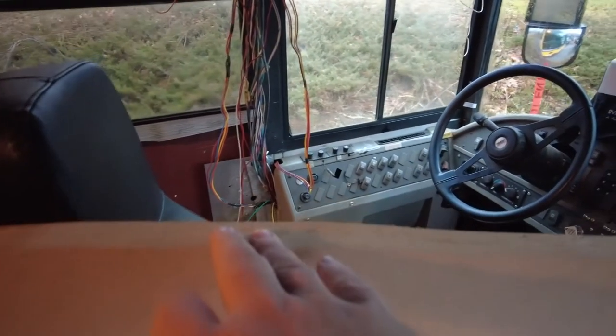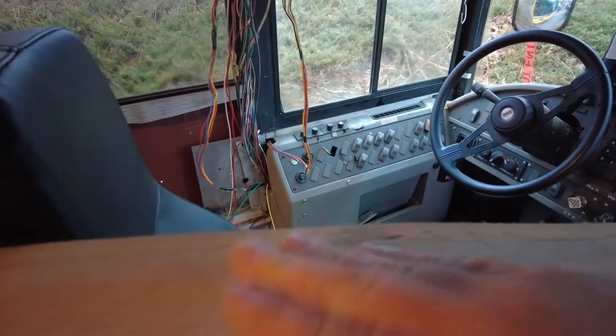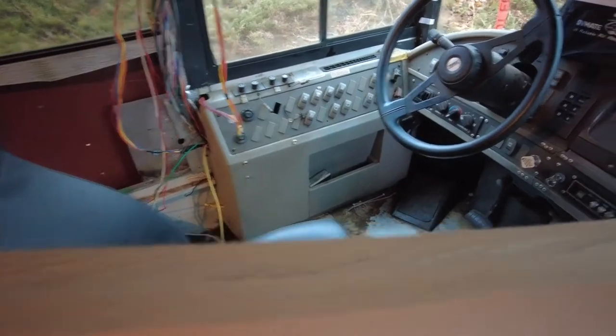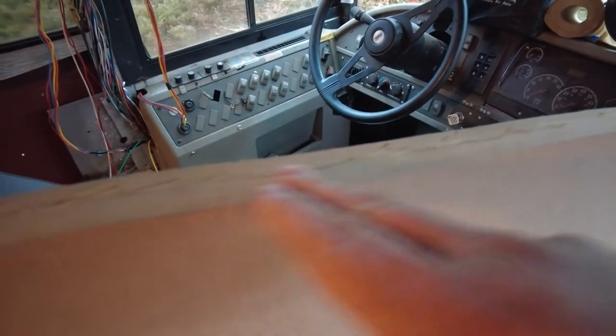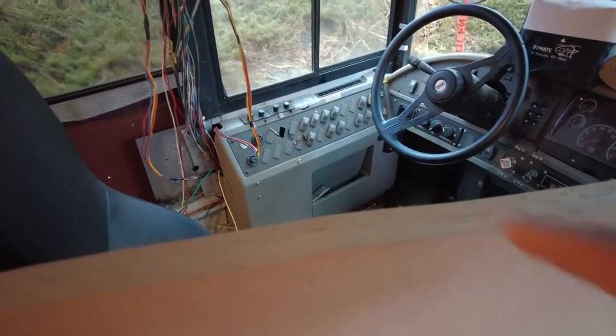It's not as shapely as I thought it would be because it was more accurately following my hammer form than I thought it could. So the hammer form, being what it is, just some MDF. And what I have done is I have screwed them together, and we actually drill and then screw through the sheet metal, and we bend it over. You can see my hammer marks where I missed, but you can also see where there's some waviness in here, and the metal that's over there actually picked up that waviness, which in a weird way is encouraging. That means that form is really working. It just means that I need to refine it a lot more.